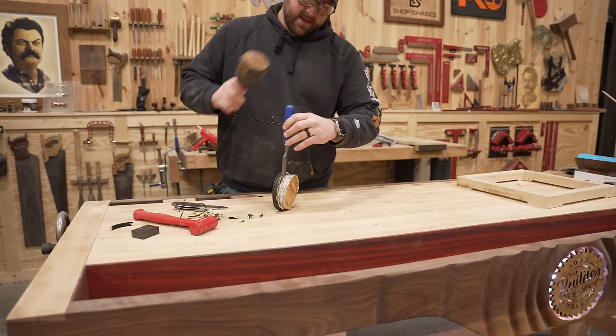It's fried. Yeah. Bitter end. So the LED pin on the board is 12 volt. I didn't realize that the Govee LEDs that we had were 24 volt. It just drew way too many amps, too much current through those pins and fried the board, so. Yay. Don't feel bad, Chris.